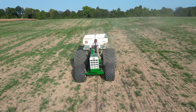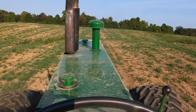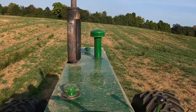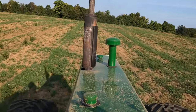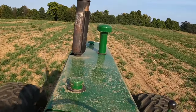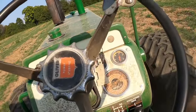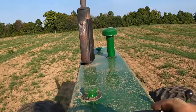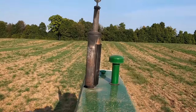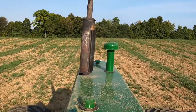So I got a bunch of, what are those studs? I think they're 3/4-inch studs. A bunch of 3/4-inch fine threaded jam nuts, which I actually had some on hand, and put them all around the back side there. I'm pretty sure I got pictures, at least from Herman, of his jam nuts, because I'm quite confident that Herman's owners had trouble with those adapter studs coming loose.